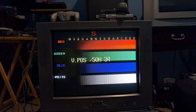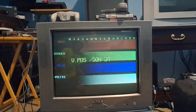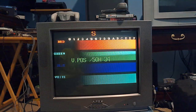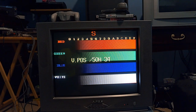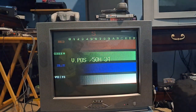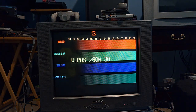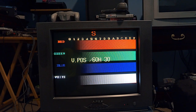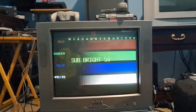As you can see, right now it shows V position. It says '50H' — I'm thinking that means 50 Hertz, which is typically associated with PAL, the video standard used in Europe and a few other places. Here in America we use NTSC, which runs at 60 Hertz. Don't get scared about this because there are 60H adjustments here as well, which is what we're going to focus on. So we have V position, V size, V linearity, and a couple other things.